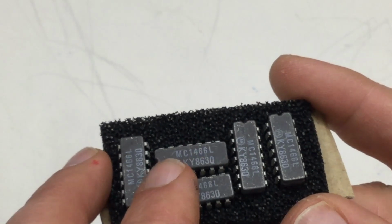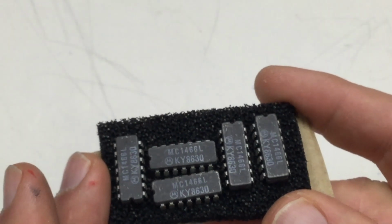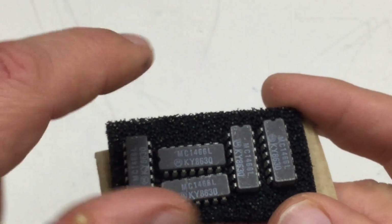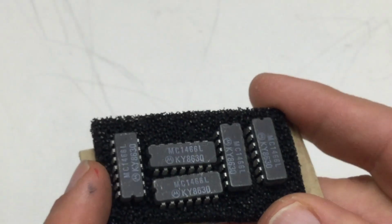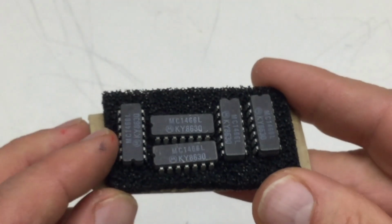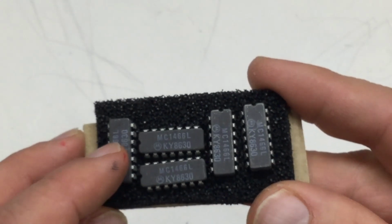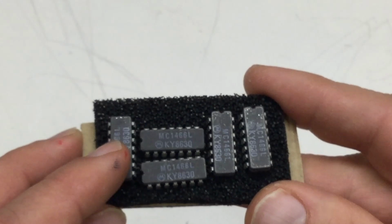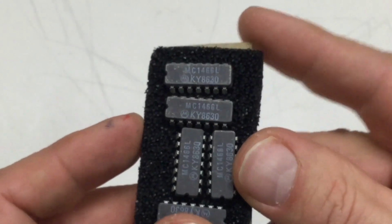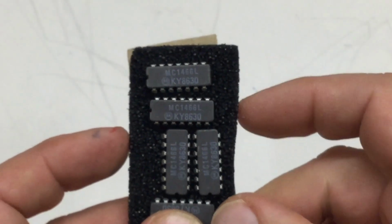ST or Analog Devices, no, LT, Linear Technology. They have very nice chips. The problem is you can either use them within their specifications, which are of course narrow because they are specialized. Then they are very easy to use and very efficient and very good. But if you search something special like me, for example, a 60 volt capable linear regulator doing 5 amps, using TO-3 power trannies, yeah, that could be a little bit hard with modern chips, but these should do the trick.